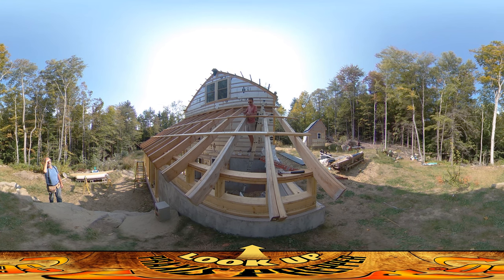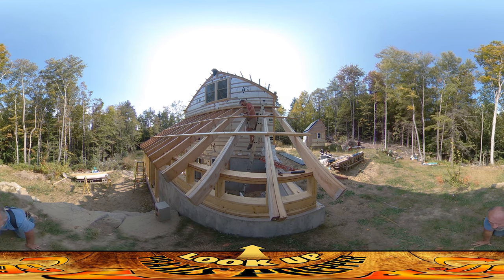I've been doing this the whole series: I'm blunting the end of the nail — I put it on some other nail and tap the end — and that makes it so instead of splitting the wood as much, it kind of punches through. It makes it less likely to split. As I'm going I'm also binding the rafters together with nails from the sides, and that's easier because it's less ladder moving.